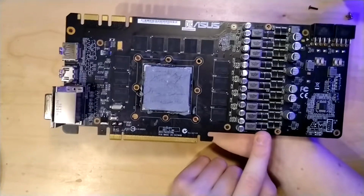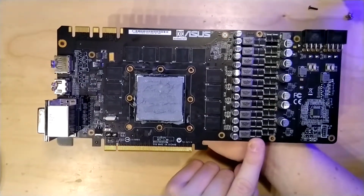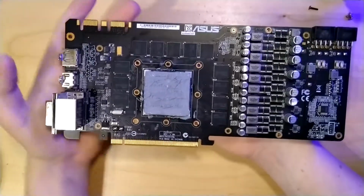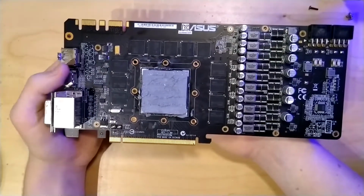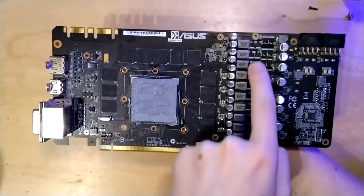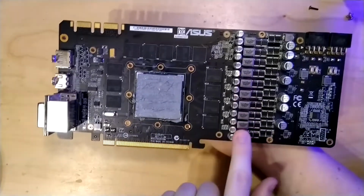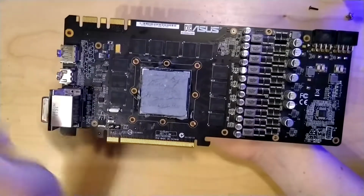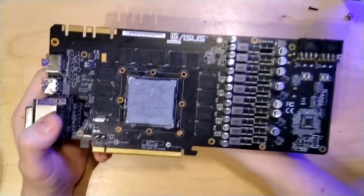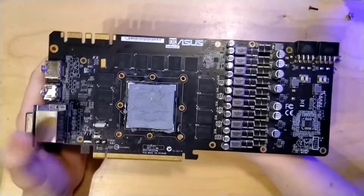And they also have an RDS on resistance of 3.6 milliohms, which is, well, it's not the best RDS on resistance, but considering that we have 2 low side MOSFETs per phase and also 8 phases for vCore worth of these, I wouldn't think that this slightly above average RDS on resistance is really a problem.